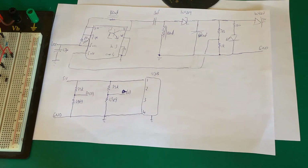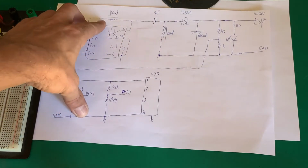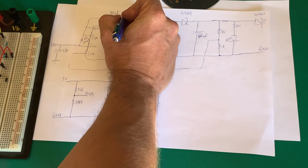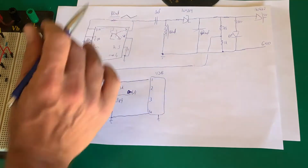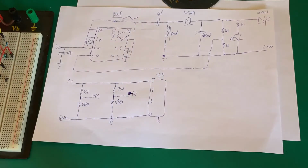To make it simple and to understand how you're going to size that capacitor, because they don't actually tell you, what you need to understand is, in this inductor, the current is going to rise over time, it's going to deplete over time, and so it's going to go on. And ideally, you want to be in a thing called continuous conduction mode. In other words, that point there never reaches zero. So the current is going to vary between whatever you've calculated, 200 milliamps to an amp. So you'll have 800 milliamps of ripple current.